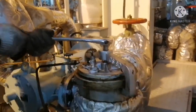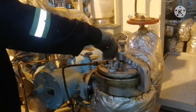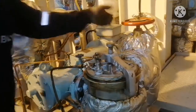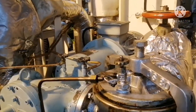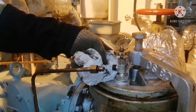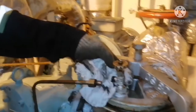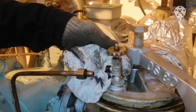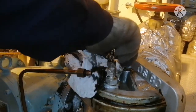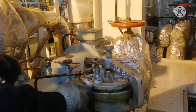Now we've boxed up the filter. For purging, open a little suction valve and close the vent valve completely, then open it very little. Open the vent valve slightly and remove the air — once the fuel starts coming out that means your filter is free of air. You can hear the air noise coming out of the vent pipe. Now oil is coming out, which means no more air in the system. Put back the connection.